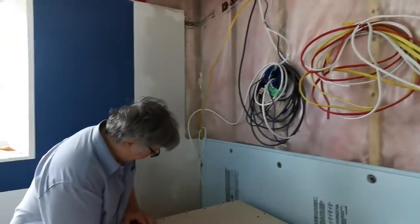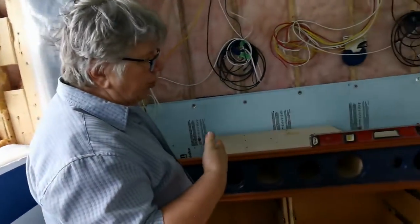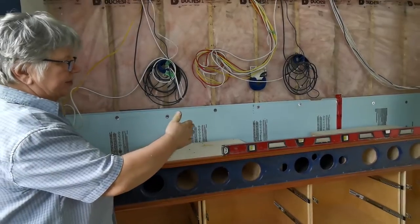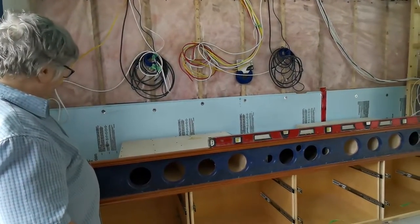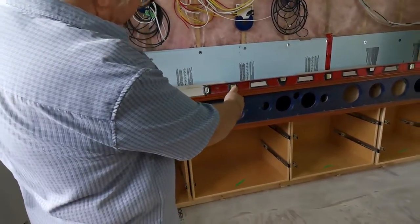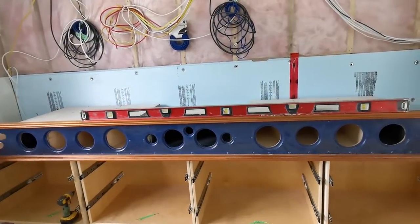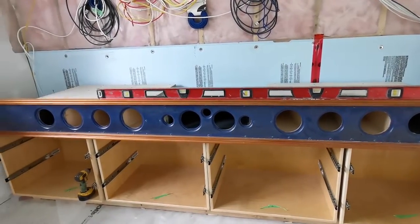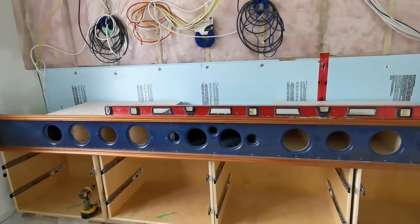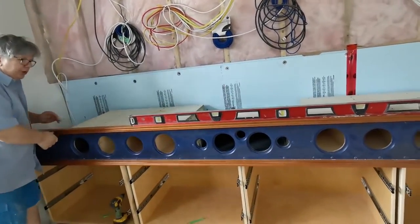So what I'm going to do now is I got this flush. One thing I learned a long time ago, don't go and make these things exact. Like when you're trying to meet for this, I've already made this in the shop. This has to be exact. This can be my piece that comes up here. So I left those spacers on perfect. I calculated about 3/4 of an inch, and you can see I'm pretty close. I might be 5/8, but sometimes you're gonna be 1/16 off here or 1/16 off there. And if I try to go exact with this, I'm gonna get burnt on install. I know I will, because I've had that happen before, and you'll end up cutting a cabinet. Putting a little spacer there doesn't really make a big deal.